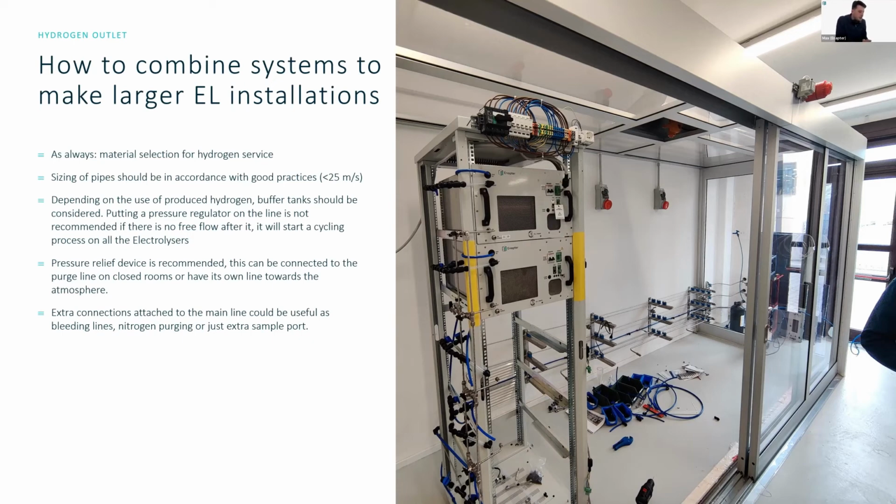Dieter Hesse is asking, will a slightly depressurized environment have any impact on safety, production rate, and cooling? You mean a low pressure environment, like on top of a mountain? No, our electrolyzers are very robust in terms of where they can be deployed, because we generally operate on a relative pressure setting. Since our electrolyzer has the anodic side, where the oxygen is produced, at atmospheric pressure, and the hydrogen side pressurized, where you deploy the system has very little effect.